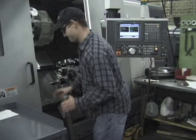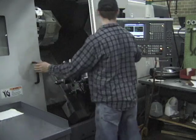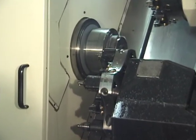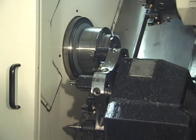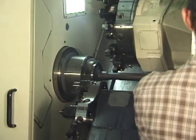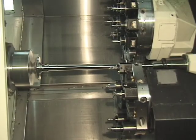The axles are initially shaped using twin turret CNC lathes with multiple operations performed with one chucking to assure concentricity. Flanges are formed and the bolt pattern added, plus any extra pocket milling. Then the bearing shoulder is precision ground and a gradual taper is machined into the shaft between the shoulder and the splines.